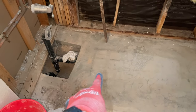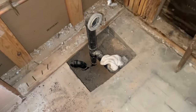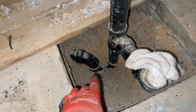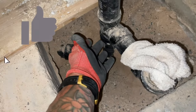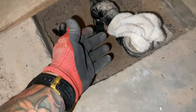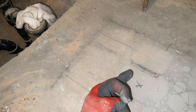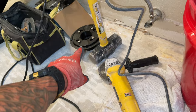We're going to be cutting the concrete right there where I've marked so we can run down. I just confirmed that we have a P-trap under the slab here, so I don't have to worry about putting in a new P-trap. I'm going to cut this down here, run a new elbow because we don't need this up for the drain — run an elbow to here, it's just going to have another turn up, and then we can put in our new drain for the shower.